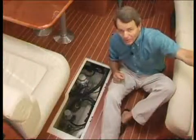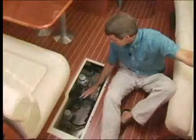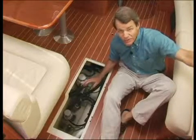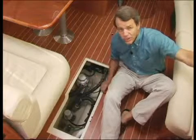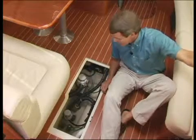Well, now I'm getting a little bit comfortable, but check out these keel bolts. They're made of stainless steel for long life and bolted through the hull, where they're fastened using large backing plates and high-grade stainless steel nuts. They're bedded in epoxy and tightened to a double-check torque specification for extra security.